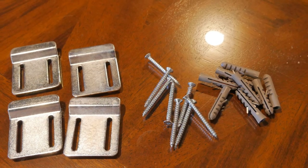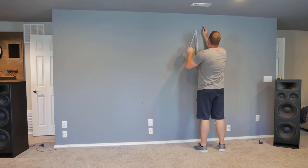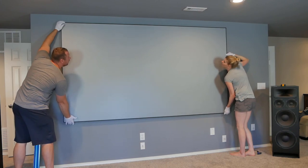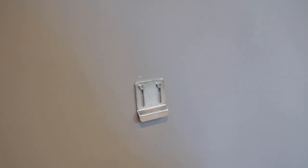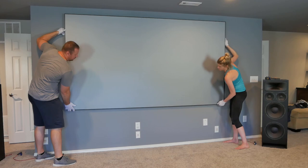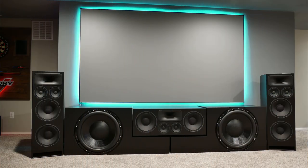To hang the screen, there are four brackets to attach to your wall. You'll only be able to hit a stud with one screw, so do yourself a favor and grab some better drywall anchors — the ones included aren't the best. Find a few studs towards the top of the screen area to secure the top two brackets, and be sure to make them roughly the same height for a level screen. There's a few inches of adjustment on the brackets, and it's a good idea to use a level when setting the screen up. The distance between the top and bottom brackets will depend on which screen size you get, so just measure off the back of the frame attachment channels. Leave the brackets loose so they can slide during the final installation. When attaching the screen, hook the bottom brackets onto the screen frame, raise the screen over the top brackets, then lower it back down. The top brackets hold the screen up and the bottom brackets keep it tight against the wall. Then you're ready to sit back and enjoy some movies.